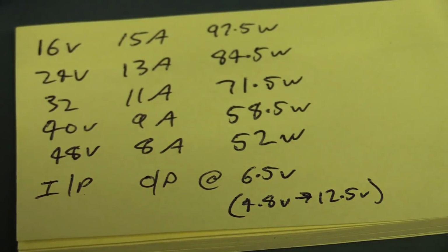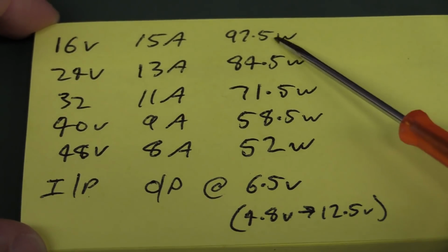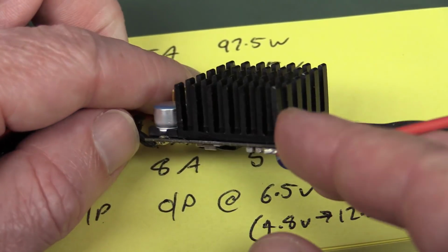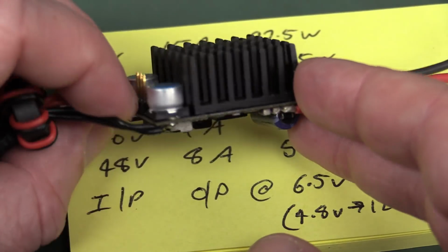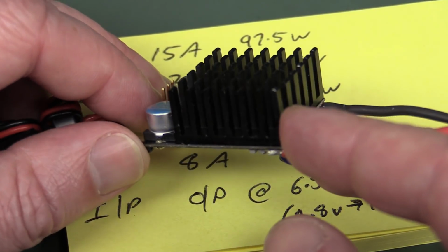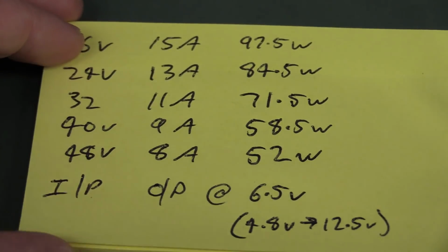And as I mentioned in the previous mailbag, that sounds a bit sus, because a heatsink like this is only going to have a certain amount of power dissipation capability, roughly, I believe, for this type and size one, about 6 degrees C per watt. So for each watt dissipated, it's going to increase by 6 degrees. We'll go into details in a minute on that.